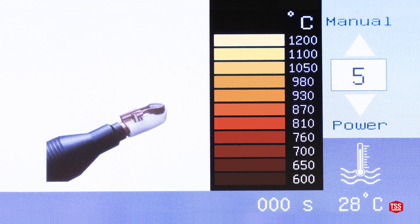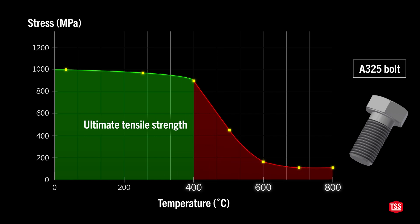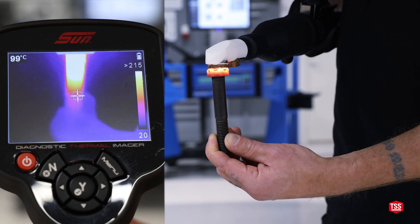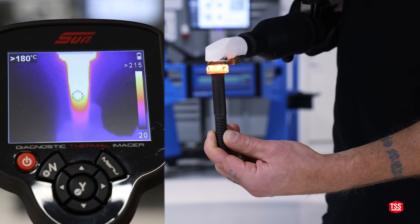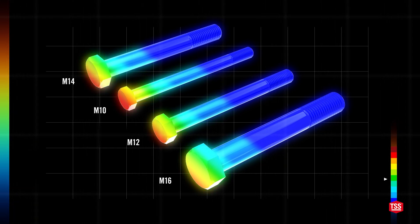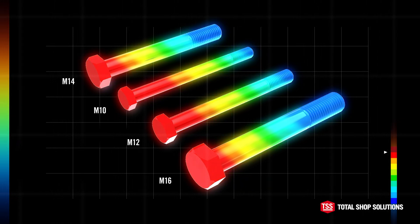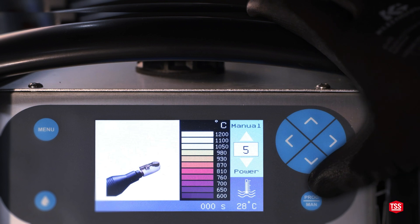This means the temperature has reached between 800 and 1200 degrees, which will have a significant impact on the strength and stiffness properties of the material. As seen in the chart, the properties of this low alloy steel bolt degrade quickly at temperatures above 400 degrees. While the head of the bolt is clearly overheated, the threads have barely been heated at all. This is due to the low thermal conductivity of iron and steel, which makes the distribution of heat through the bolt very slow.